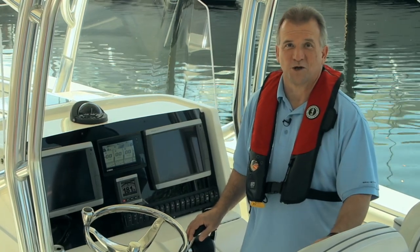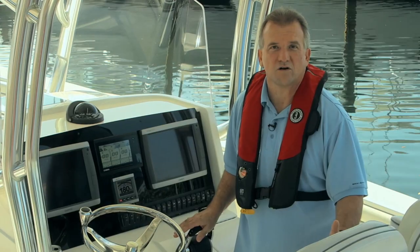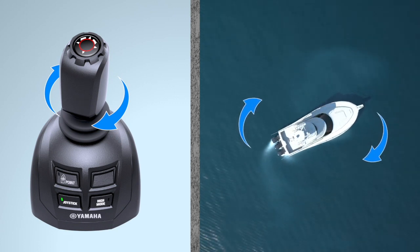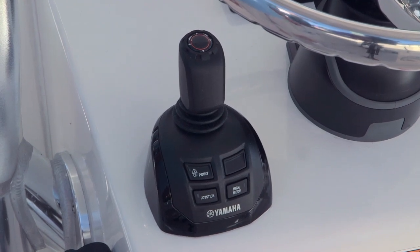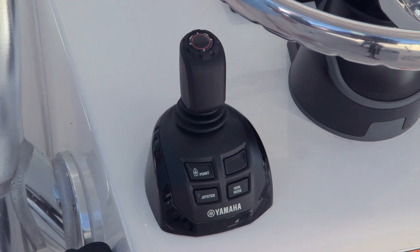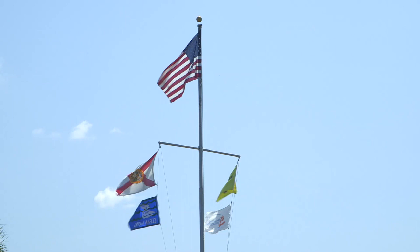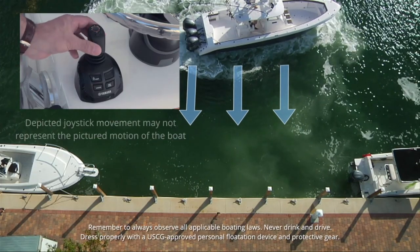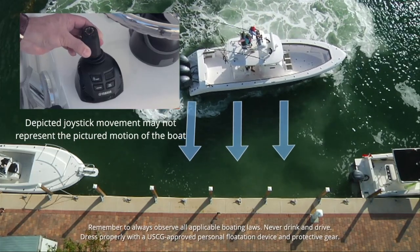Now let's try sideways operation. The port side of the boat is represented by the port side of the joystick, and the starboard side of the joystick corresponds to the starboard side of the boat. To move the boat straight sideways, simply move the joystick straight sideways, using less and less movement as you get closer to your desired destination. Oftentimes, things such as wind, current, and boat loading can negatively affect overall boat motion when in joystick mode. This is corrected with a simple twist of the joystick while holding the sideward pressure — whether the bow is lagging or leading, a simple rotation of the stick will get your boat back on a true sideways tack.